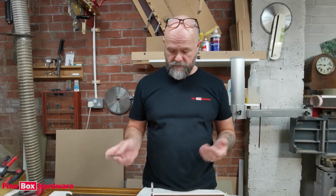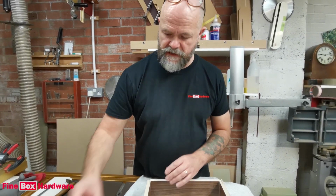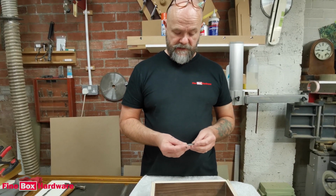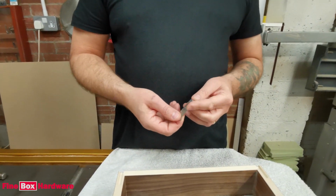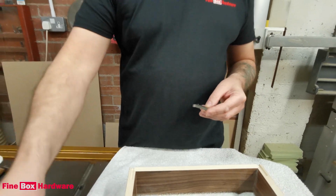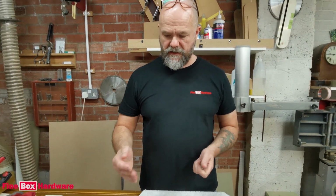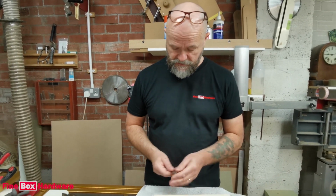It's just the way it is, okay? So we developed this wee simple jig. Really basic. Look at that. It's the same as the mortise, so same width, same radius. The holes are offset by 0.1 to the front, okay? This is ensuring that your hinge is pulled tight into the mortises that you've routed, okay?